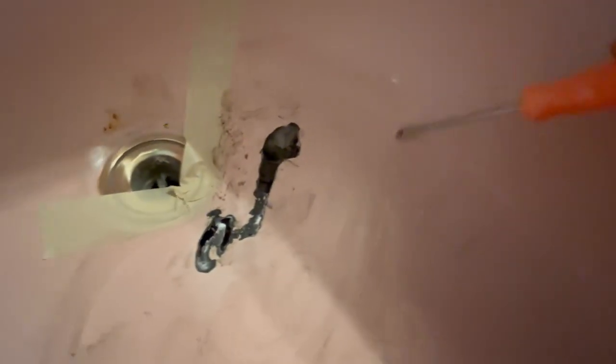See that? This is a big hole right here. And then it's rotten a little bit here, and then it popped through here again. So we're etching this all the way back to here, so our fiberglass filler has really good adhesion to the porcelain. We're going to let that sit on there for a little bit. We're going to clean that off really nice, and dry it with a heat gun.